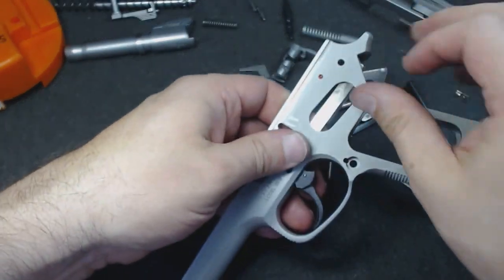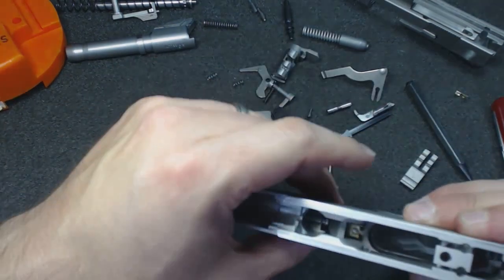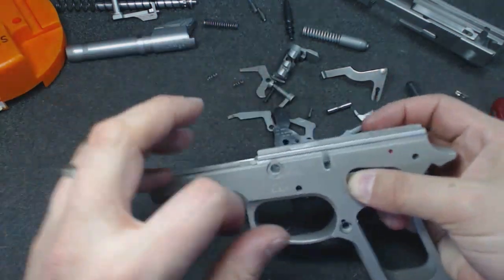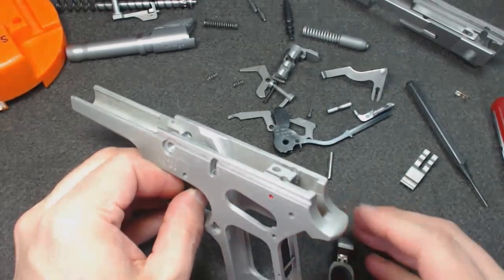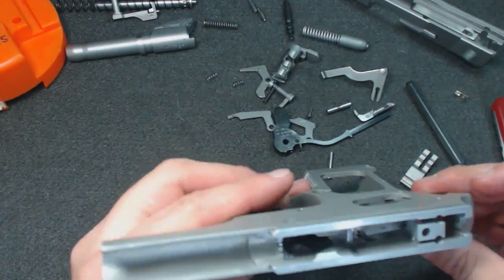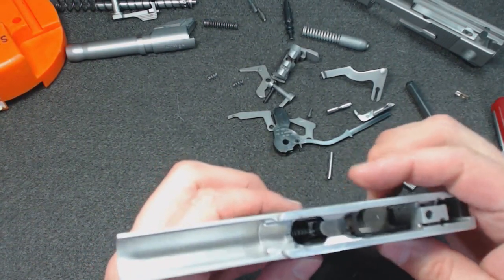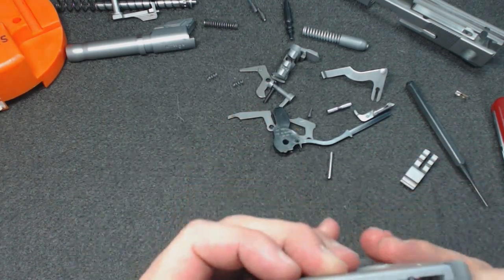So, that's one of the critical pieces. And then after that, we're going to make sure that the trigger itself has... Whoops! Yeah, not done that. So the trigger bar has to pick up the return spring. Otherwise, we'll squish it, and she won't work right if she's squished.